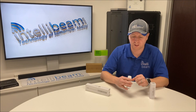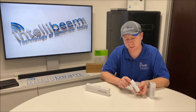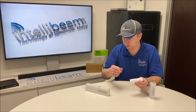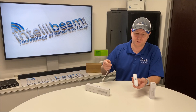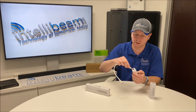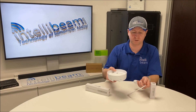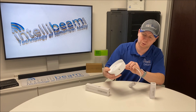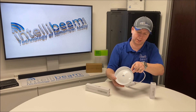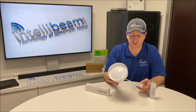It's labeled with passive 24V out and the normal 802.3AF in. So you can use your normal PoE switch, run the Ethernet cable out of that into here, and then out of this port you can plug in your Ubiquiti radio. This way you don't need two different kinds of switches — like a combo switch — and you can power your Ubiquiti devices with just a normal PoE switch.